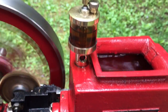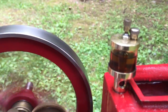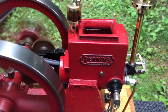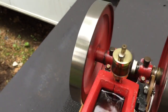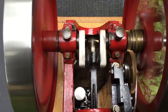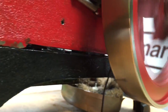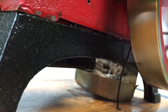That was just regular 30-weight oil in the oiler. Turn this out a little bit once you fill it up, and you can see in the sight plug in there it just drips every once in a while — that's upper cylinder lubrication. You want to lubricate all the moving points. If it moves, oil it — you can't use too much. Since this is an open crank, it's open underneath too. There's a little tin underneath with a rag in it that catches some of the oil that drips off the connecting rod.